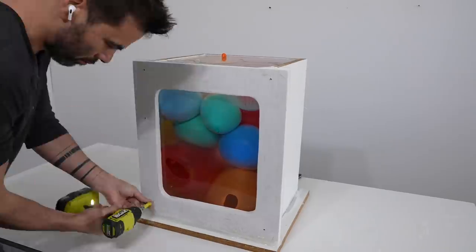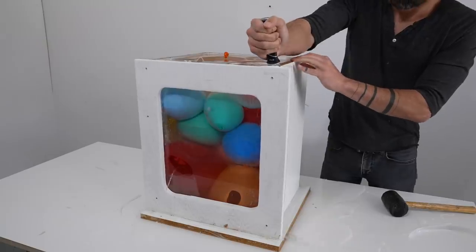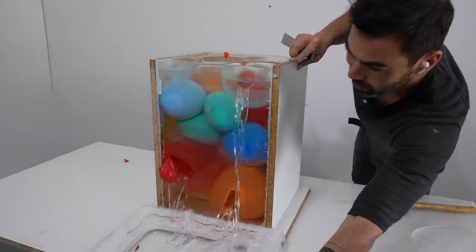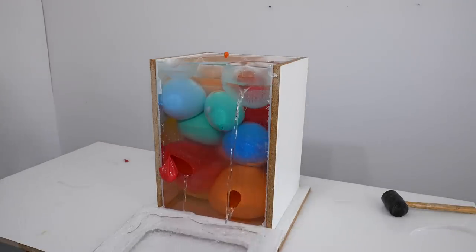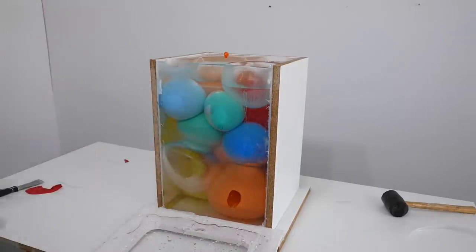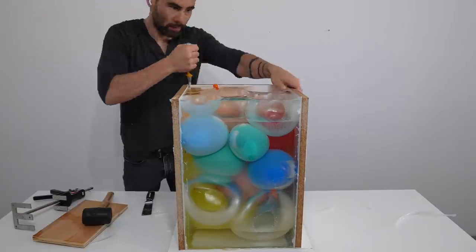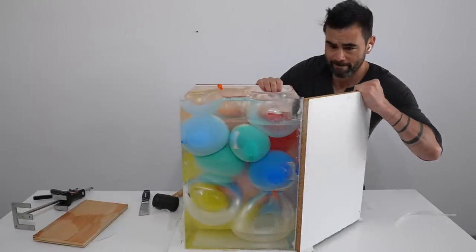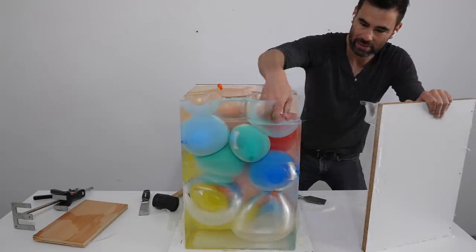All right, so far so good. Let's remove the screws, cut away the glue and silicone, and pry off these panels. The balloons came out of the cavities really easily and I was even able to just pull out most of the balloon knots. The mold release was great for removing the side panels, but some of it did ooze down and get in between the layers of epoxy, so one of the little corners broke off as I removed the melamine.